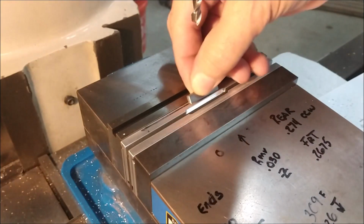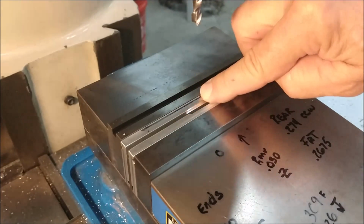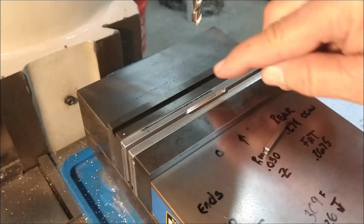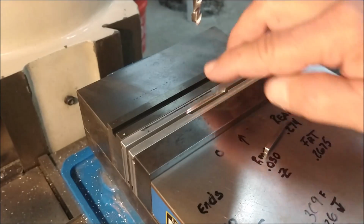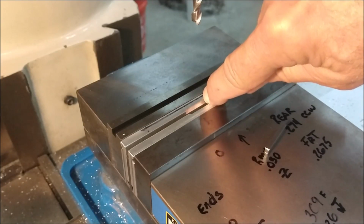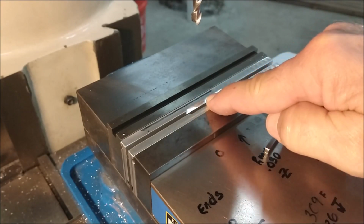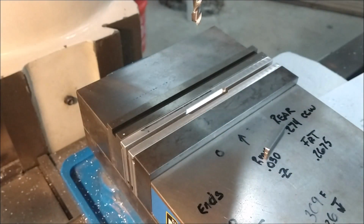Okay, step one, the trough is cut in the aluminum jaw, longer than the actual part. What do we know about that trough? This is a 249 cutter, so it's about 125 to the center of that existing feature that I just cut. Now when I open the vise, it's still going to be 125 off the back edge. So I'm going to bring the table towards me, 125, and now I have my 0 edge on the back. Okay, no edge finders, no indicators, no nothing.